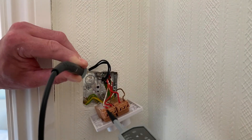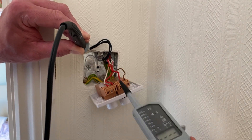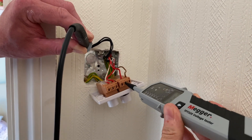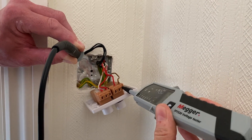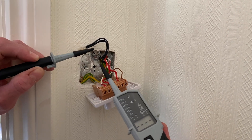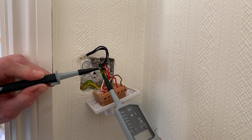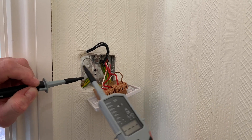Let's try neutral: connect onto the neutral connection and the switching line — again no voltage present but there's a continuity beep. Then switching line to permanent line, and switching line to the line connection. So what we've got is: sometimes we're getting a continuity reading — they are connected together — and sometimes we don't, but there was no voltage present at all. It was just that continuity beep from the voltage indicator.